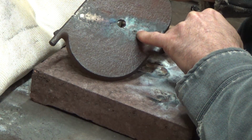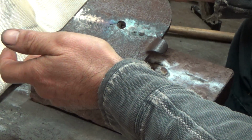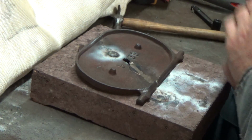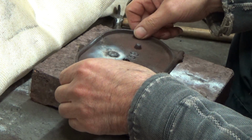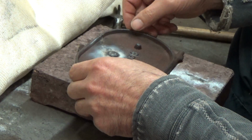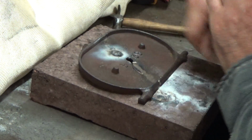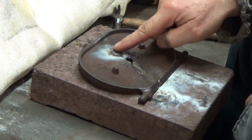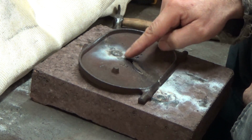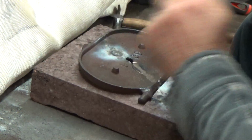And you know, the penetration was good. Look at that. But I think it would work if I could keep it hot, but it's such a large surface area to keep at welding heat. I suppose you'd have to try. It would be more trouble than it's worth. So what I'm going to do is take it outside. Might as well grind that back now, and then grind out any cracks again, and then I am going to braze it.